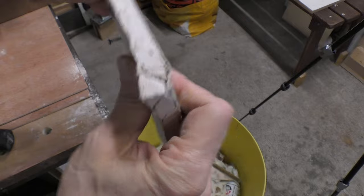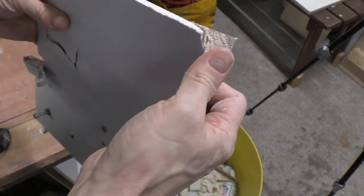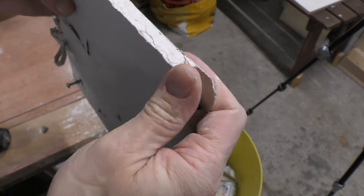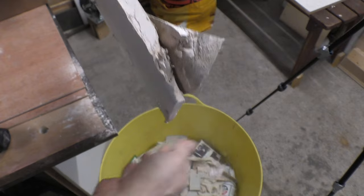The reason it's difficult to fix into plasterboard is because it's an inherently fragile substance. If you can't rely on stud work or the brick wall behind, you've basically got to fix into a substance that is brittle to say the least. So you want something to open up as wide as possible behind the plasterboard, and this has been the challenge for manufacturers for the last 20 to 30 years.